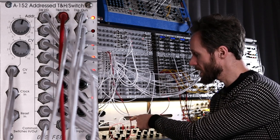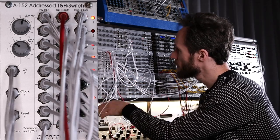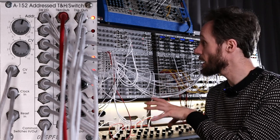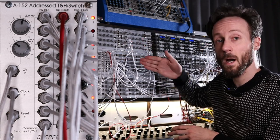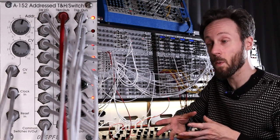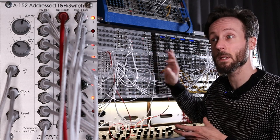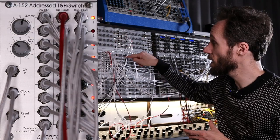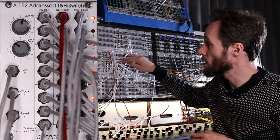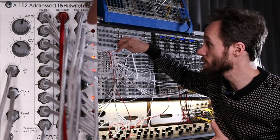The oscillator going out of the Moog Matriarch is going into the addressed switch, into the control voltage input, so it's like you turn the address knob at audio rate. Everything I'm putting into the switch here, the I/O section, you can use in a bi-directional way, so you can put 8 signals in there and get one out, or put one signal in there and you get 8 outs. When you turn the address knob, you will actually switch between all those different outputs or inputs,